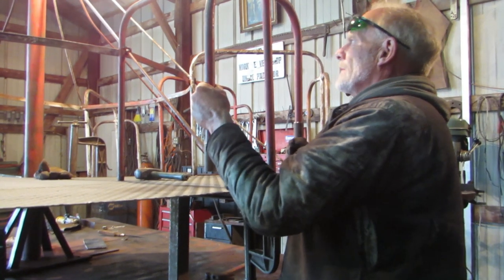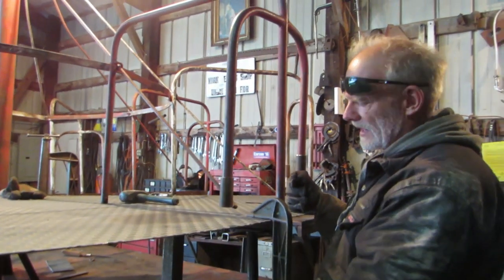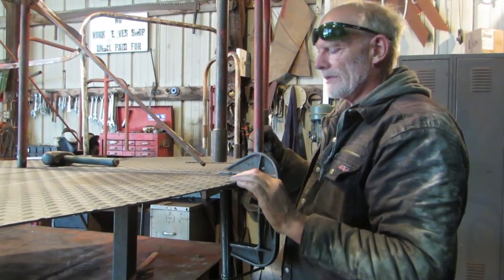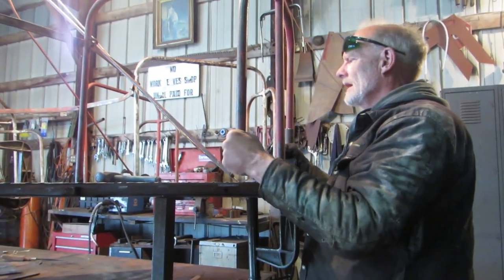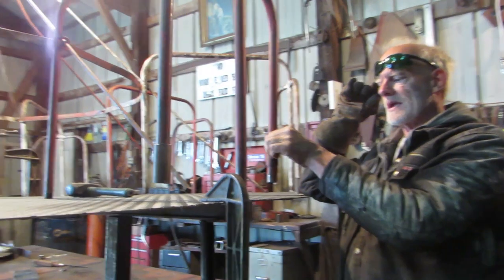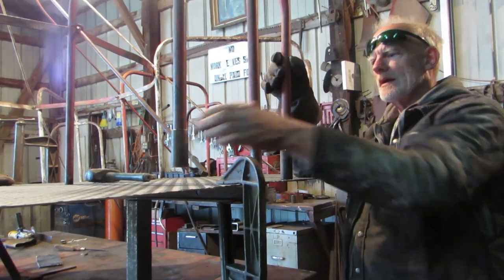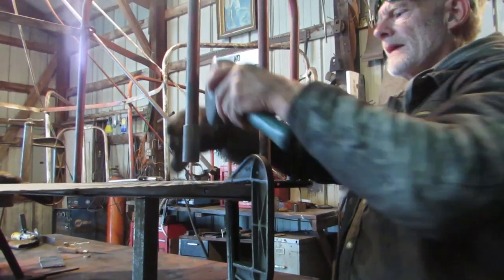Now the railings that the children hold on to that I had to cut off to get this plate in, now that I've slid it over on top of our jig, now I'll weld the plate to this bottom member and attach the handrails to it. And remember our little problem we had. I just made these pipes that fit right over the top one. I'll bring those down, and I'll be able to tack it to our plate.